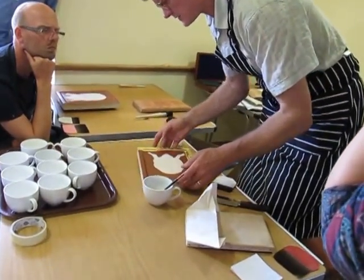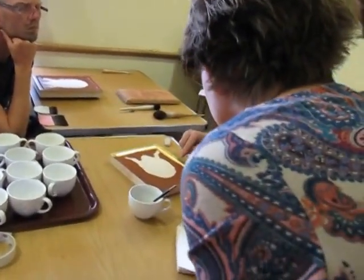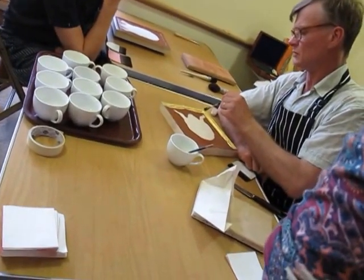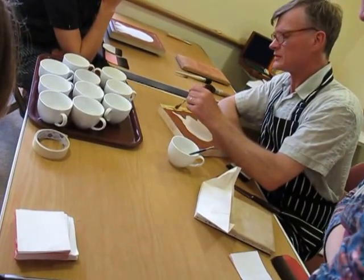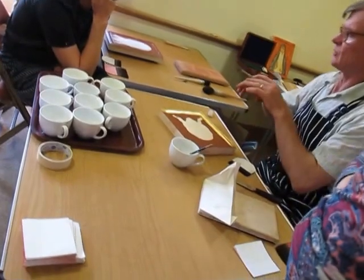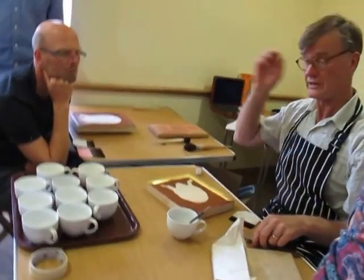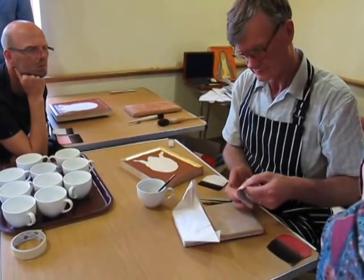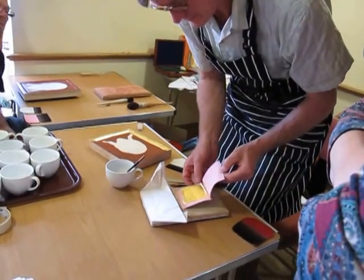The wrinkles here are quite thin compared to the fat ones — that's a sign it's probably okay to tap, just very gently. Corners tend to trap more moisture, so be wary. Tap down the join carefully. If it moves, there's probably still water there. If there's water and you push, it'll scrunch out — you'll actually see the ripple underneath. I prefer to stand up, but the ideal is a bench height that's just right for you.